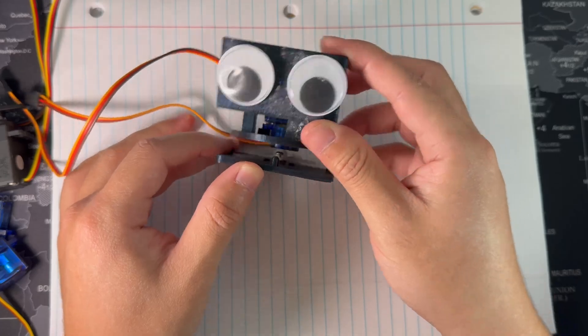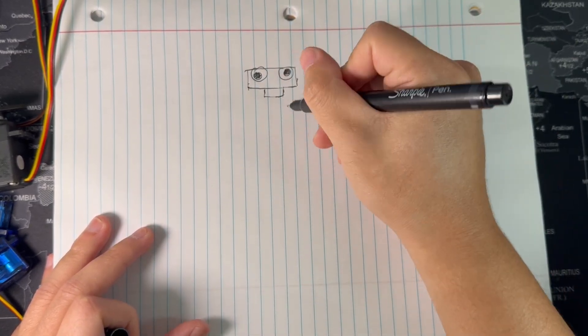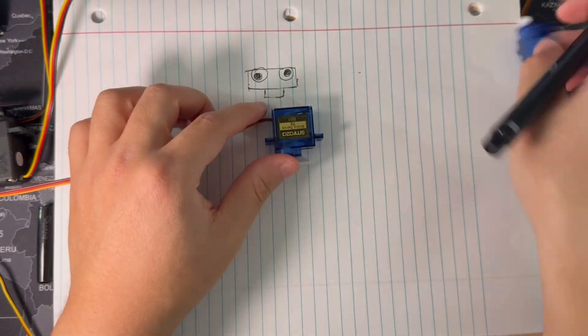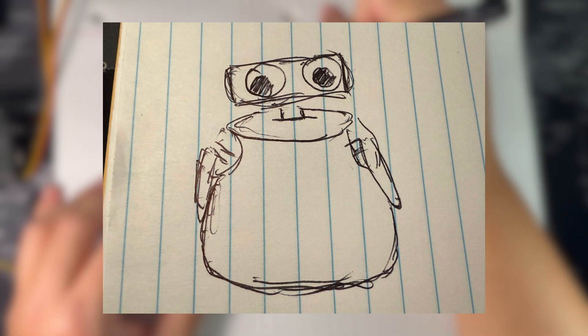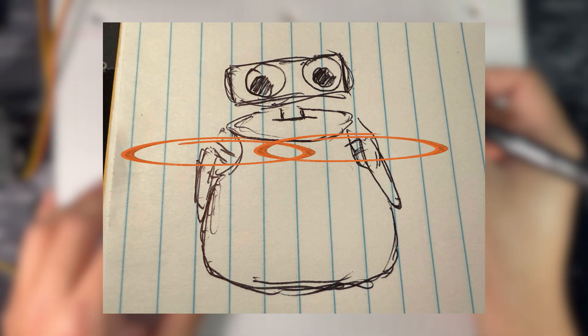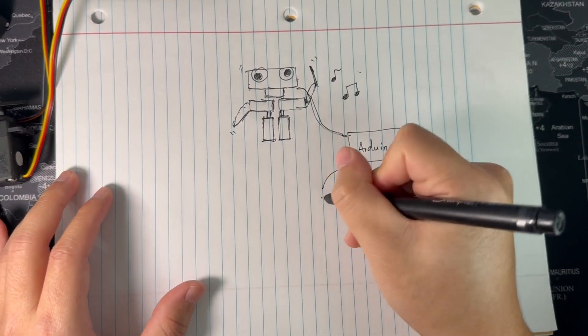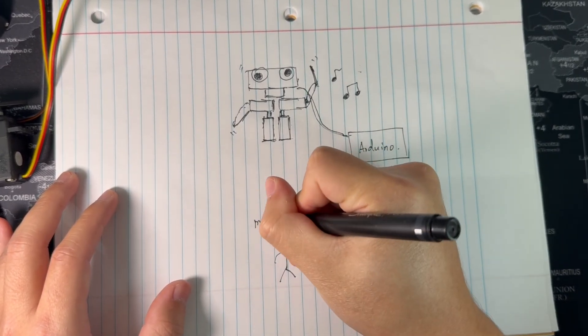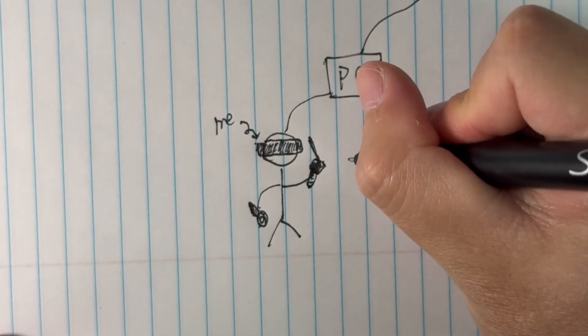I hope this gets you really excited about building robots. Let's get started. A couple months ago, I decided to go with a two degrees of freedom design that incorporates two servos, which allows for a compact configuration. For the hands, it's really just a replica of the head. With two servos placed horizontally and vertically, the head can rotate left to right and up and down — and the hands work the same way. We'll connect the servos to the Arduino as a microcontroller and connect that to the PC through a USB port with serial communication. From there, we'll use the VR headset and controller to command our servos to follow our movement.